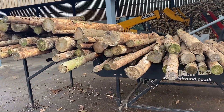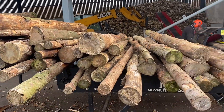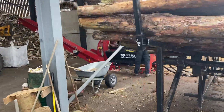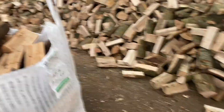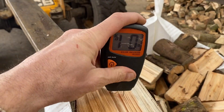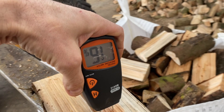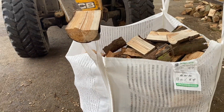We're just on the softwood now. This wood sat on the top of the stack that we're chipping — it's sat there for about two years. We'll moisture test it and have a bit of a look, but it should be sub 20%. It's actually 16%, 18% — so yeah, that doesn't need drying in the kiln at all, straight out.